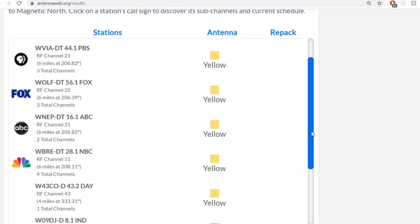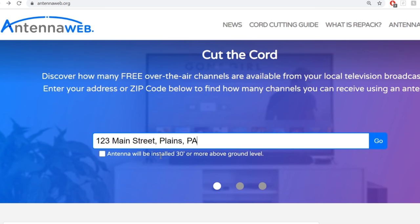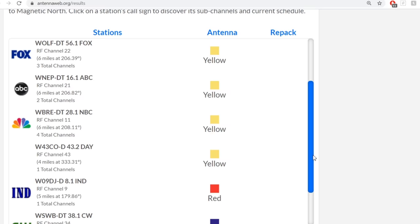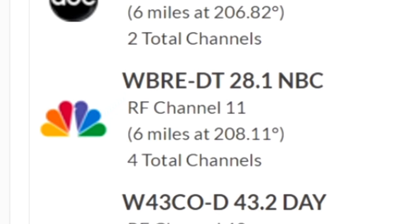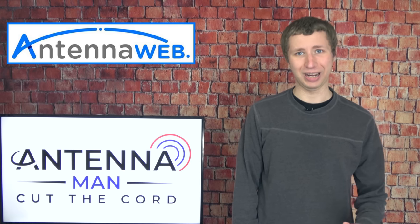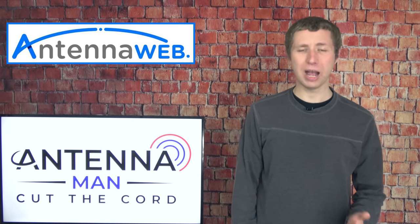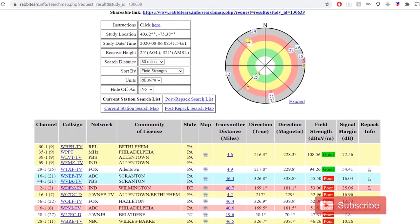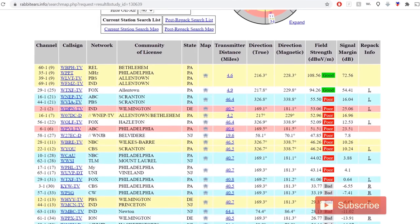To find out what channels your local TV stations are broadcasting on, go to AntennaWeb.org, type in your address, and click the check mark that says the antenna will be installed 30 feet above ground level — even if it's not — and it will provide a list of stations you can likely pick up. Look at the RF channel on each station; that's the channel they're actually broadcasting on. For example, WBRE 28 actually broadcasts on VHF channel 11. If you don't see any channels listed, don't assume you'll get nothing — AntennaWeb tends to underestimate reception. You can also use the FCC DTV reception maps or rabbitears.info, both linked in the description.